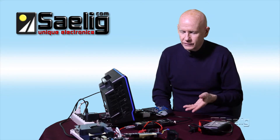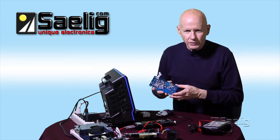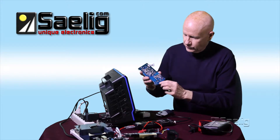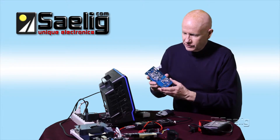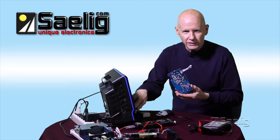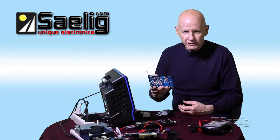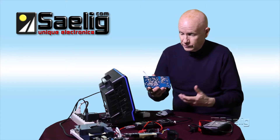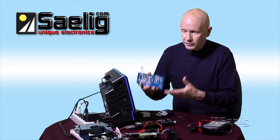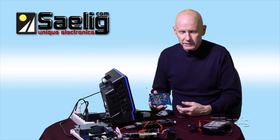The reason you need a differential probe here is because if you look at the schematic of this board, there is absolutely no place on it other than these two little holes connected together that is actually the same ground-referenced point as the BNC shell on the scope. Everything else is floating or has its own ground reference for its own circuit. So just attaching a regular probe from the scope to here just wouldn't work at all.